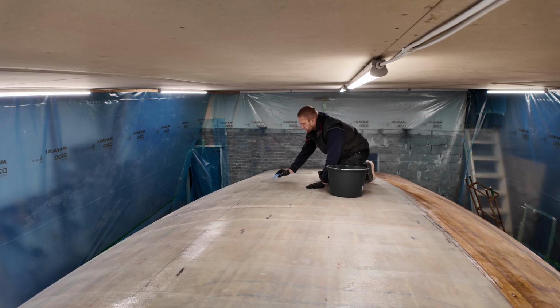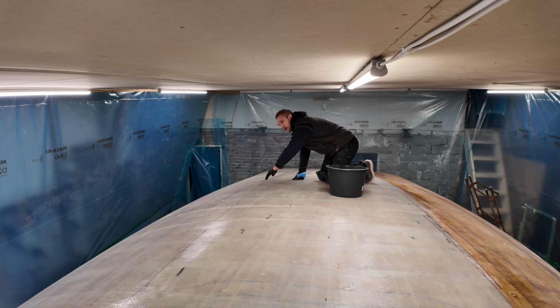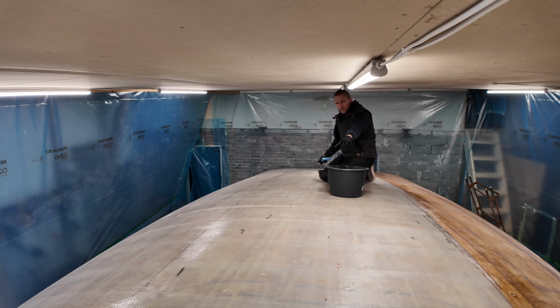So I'm getting the hull ready for the lamination on the starboard side that we plan to start this week. But first, you see we have this overlap section here at the midsection of the hull. And we're going to do the same from the starboard side, overlapping to this line here. So the hull will have twice the thickness of the laminate here in the bottom part, same on the inside